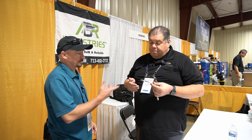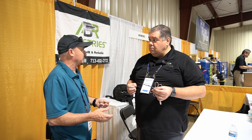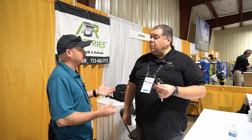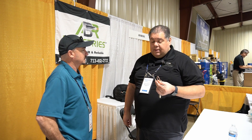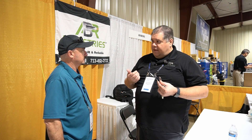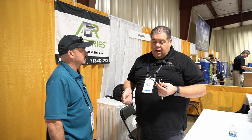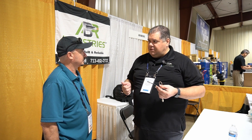I could see this being super useful in the shack because people like myself are constantly moving things in and out, swapping things around — going from a PL259 on this radio to a BNC on that radio. That would be a great solution if you just want to hook something up quickly and maybe test it out. Also for test setups — you've got TDRs and other devices that have an SMA or an N connector. Now you can easily switch between the two if you're hooking up to a standardized dummy load or something else. You can also use it when you get a new piece of equipment and you're just never sure what you've got — you can always make that decision on the fly.